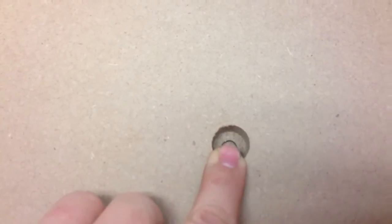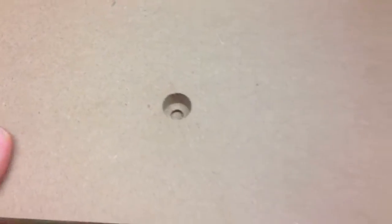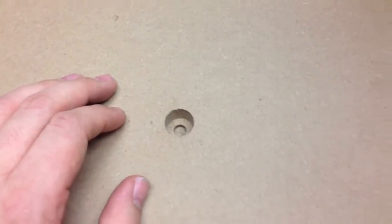Hello YouTube, just finished getting my first cuts done and you can kind of see what it looks like. I left the through hole about 30 thousandths of an inch from the bottom and figured I'd just run a drill through there. I didn't want to get through to the aluminum underneath it. So I've got a seat for the nut to sit on and I'll be able to bolt this down to the surface.